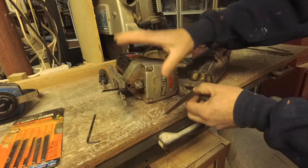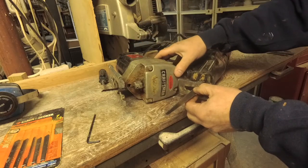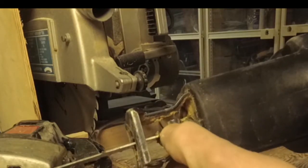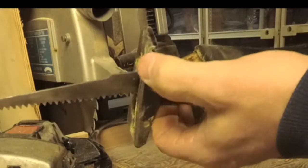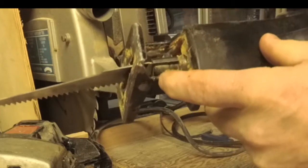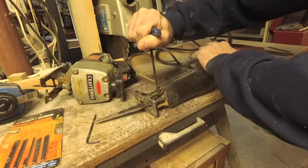So that's how the blade changes in a scroll saw — there's two screws, and pretty much every one I've ever seen, that's how you do it. It's pretty simple and straightforward. In a sawzall, it's very simple as well. In fact, it only has one screw. Hopefully you can see this plate here I'm pointing to. That plate squeezes against the blade against the shaft that comes out of the housing and goes back and forth. When I loosen it up you'll see what I'm talking about. There's a pin on part of this plate that catches the blade, and I'll show you that.